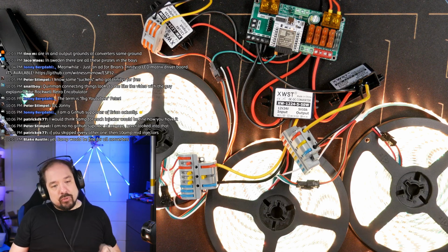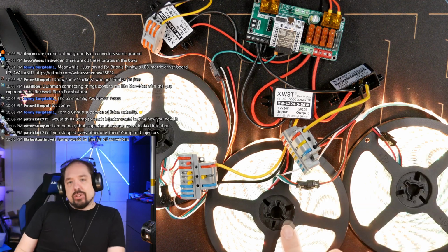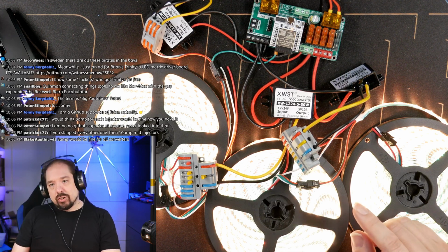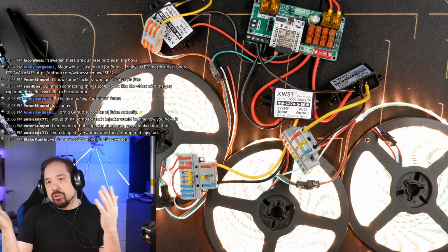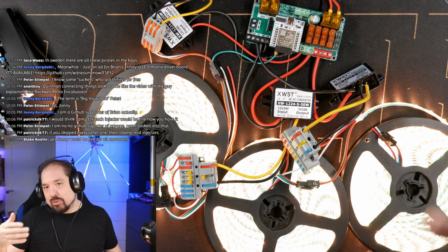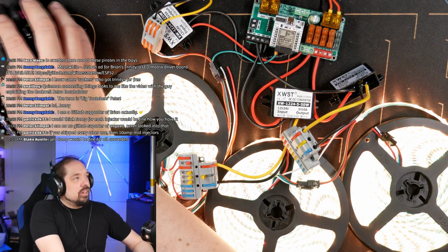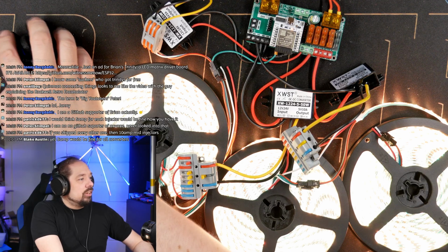Oh, you think 5 amp for each injector would be fine how I have it. That depends. 300 ws2812b LEDs can use up to 13 amps. So a middle injector will go left and right, so it could easily feed like 200 on the left and 200 on the right. And then even 10 amps officially wouldn't be enough if you do full brightness white. Now, generally you don't do that, but let's say currently this seems to still be working fine. We can quickly do that.